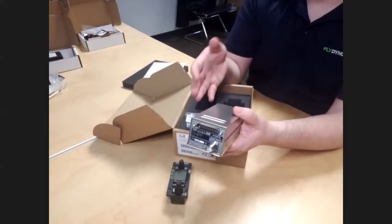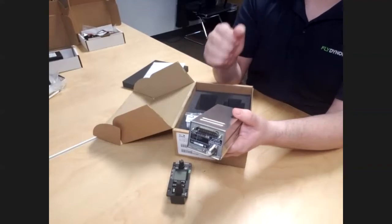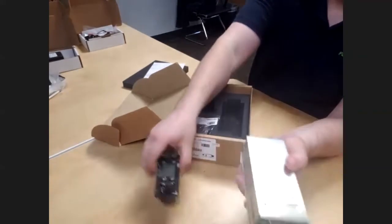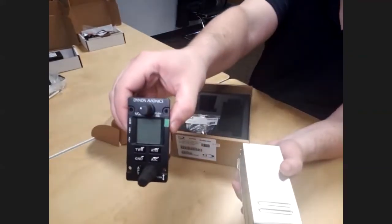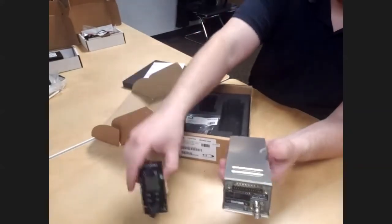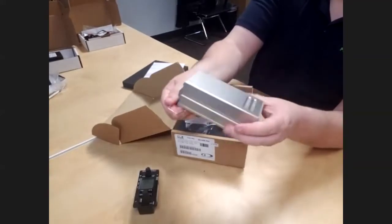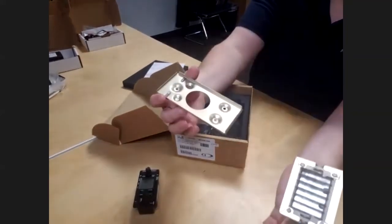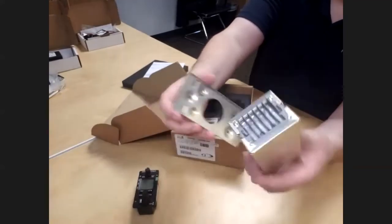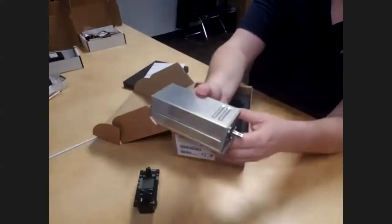So you would have numeric active and standby frequencies, just like a radio of old, even if you didn't have SkyView connected to it. And when you add SkyView, of course, then your tower, ground, ATIS, and ATC buttons are all referencing the aeronautical database that lives in the display itself. So the radio, again, just like the transponder, a simple wire clip opens it up and it removes from the mounting tray. This guy is lightweight, easy to mount just about anywhere you want it. And then the radio just drops right in, sets in place, and locks it.